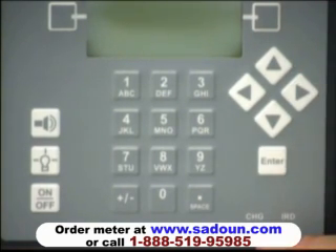The enter button is used in conjunction with selecting different menu items. In the lower right corner we have two LEDs. One is labeled charge and it illuminates yellow when voltage is introduced, either AC or DC, and that yellow denotes the voltage is fast charge. Once the meter is significantly charged, it will turn green, denoting a trickle charge.